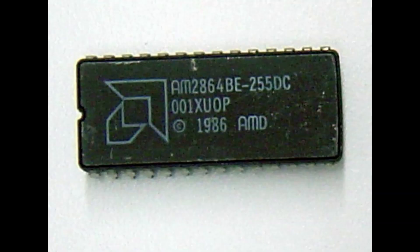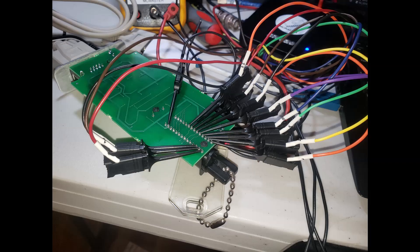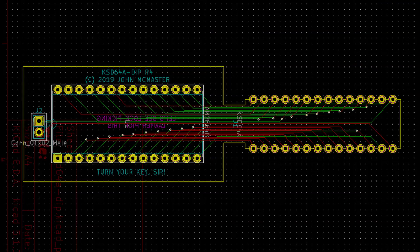While both AMD and ZICOR were official parts, only the AMD parts were easy to get. Now, with a strong lead on the internals, I looked at Crypto Museum's X-rays to make a preliminary pinout guess. I then took apart my PKS-703 and attached a logic analyzer to refine connections. This gave me enough confidence to fabricate an electrically compatible PCB.